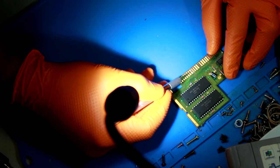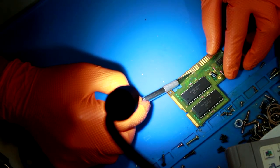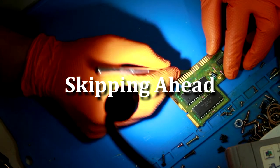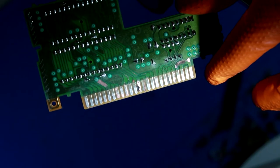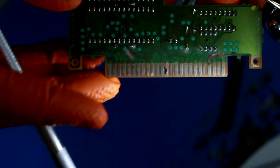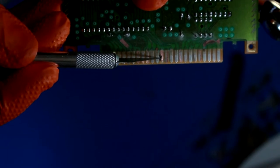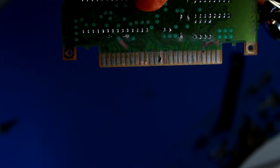Once it starts rusting up and turning brown, the best thing to do in my personal opinion is just to get that stuff off there. Yes, it removes some of the coating on the pins, but what does it matter if it's rusted anyway? I've cleaned off a good amount of the corrosion. There is almost a hole here - I dug some of the brown crud out and it just goes to black. I'm going to have to fill that in with something. Let me bust out the multimeter now that I have this stuff cleaned up, and check continuity.